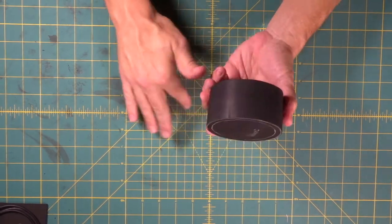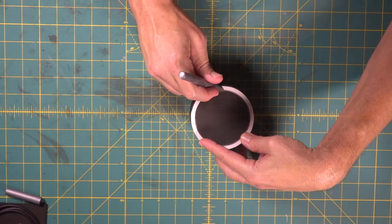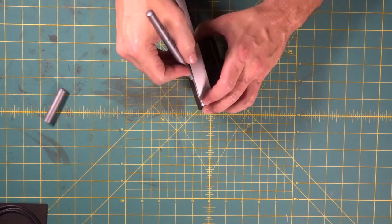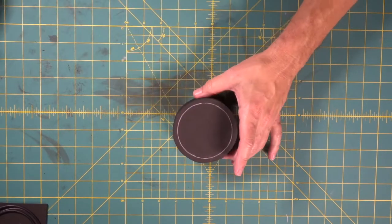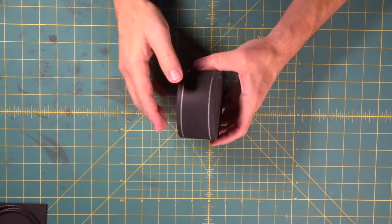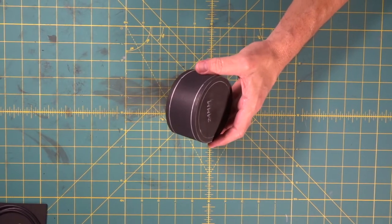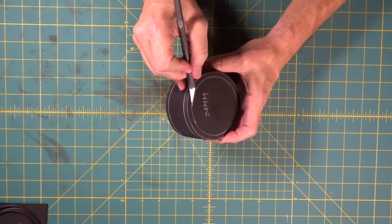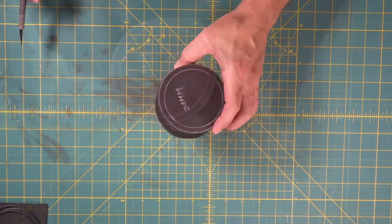Alright, there we go. Check that out. Nice, man. Love that scroll saw. Alright, there we go. That easy. We've got a 1/4-inch mark around both sides, and we've got a 1/4-inch inside. Okay, now you've seen us do this before. We're going to come in with our Dremel, and we're going to Dremel from this line to this line. And there's going to be a bevel all the way around both sides.